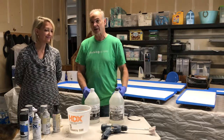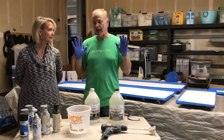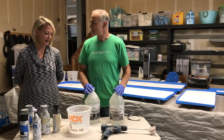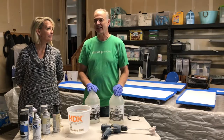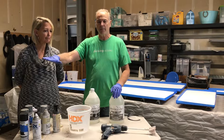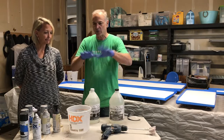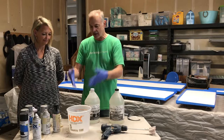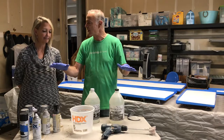What we're going to be using is this epoxy that's mainly used for countertops, by Stone Coat Countertops. We've done our entire kitchen with this, our master bathroom, and a wet room, so we have some experience. Today we're doing something a little different — a dirty pour, sometimes called an exotic pour. Instead of pouring white and creating veins with our hands and popsicle sticks, we're going to mix all the colors into a bucket and pour it out and let it flow, kind of like mother nature, to recreate a look you'd find in nature.